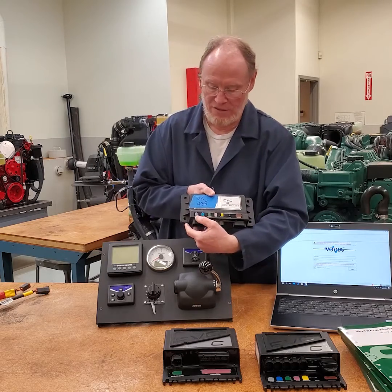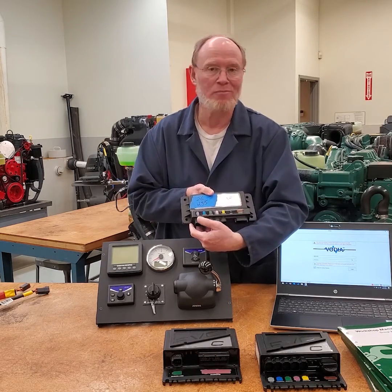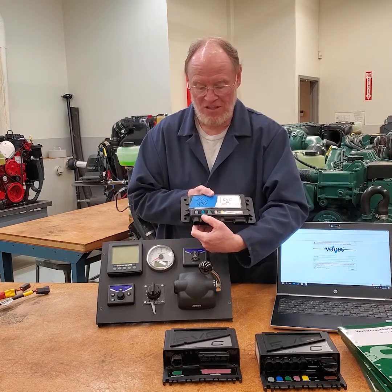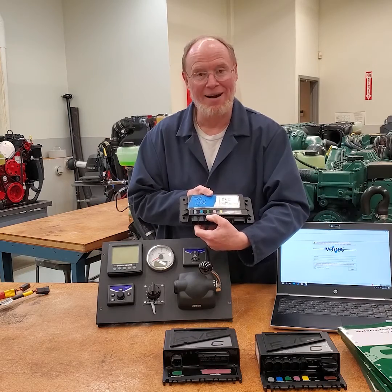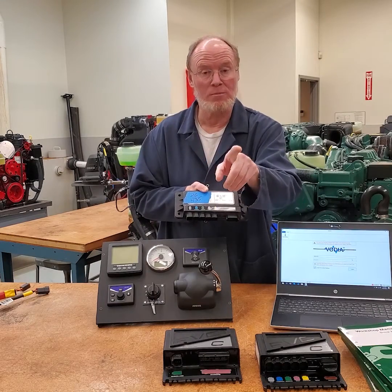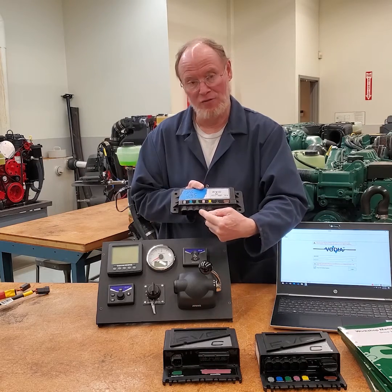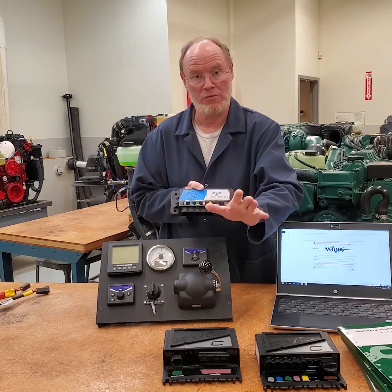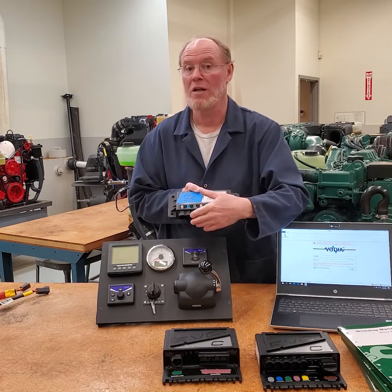For example — I know you can't see it that far away — X4 key switch is gray, or maybe blue, color blind. X7 controls looks blue. X2 data link goes down to the engine to the PCU, so that is the major connection that connects from the helm to the engine, but it goes to the PCU, not to the ECU, which is the engine control unit.